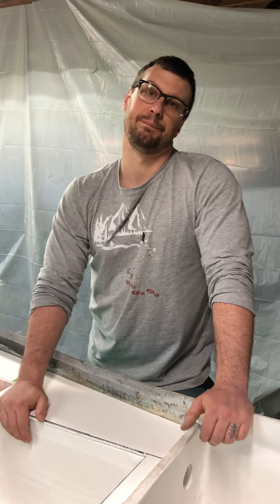Underneath all this floor, if I get any water up in the nose, I actually have a tunnel going through the middle of all this floor all the way up to the nose with a hole down here that can be sealed or removed. So if I take on some water, I can pull this plug out, the water can come up and drain, and my automatic bilge will pump it out. I also have a hole at the bottom of the transom so whenever I'm done I can open it and let everything drain out.